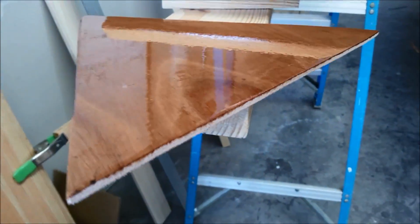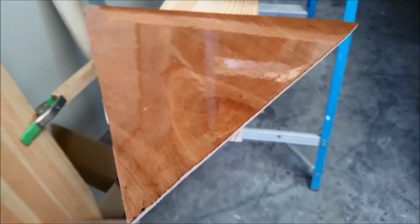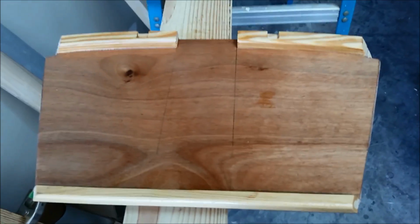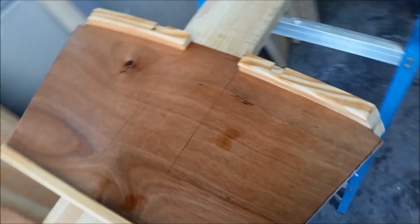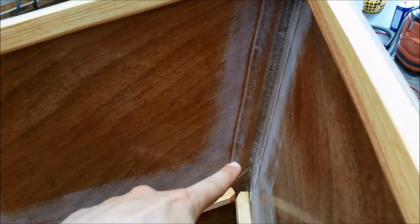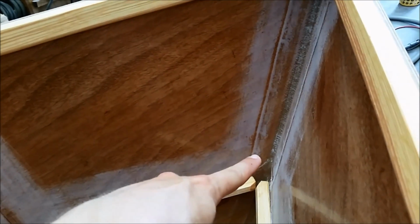For comparison, here's what the bottom of that seat lock tabernacle locker floor looks like after I sanded it with 80 grit and put a last coat of epoxy on it. So it's still a little wavy surface, but it's smooth and it's got a thick barrier coat, which is what we want. And I've gone ahead and epoxy coated the front of this tabernacle bulkhead, and I've sanded and coated these cleats, and I've scuffed up the stem because I'm going to be installing a block in there that the bow eye will be installed into.